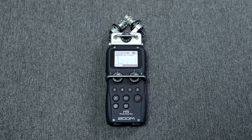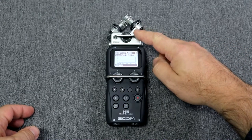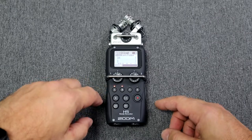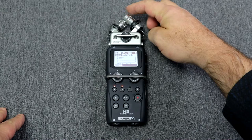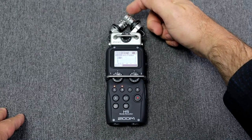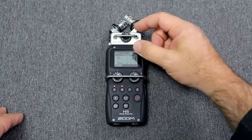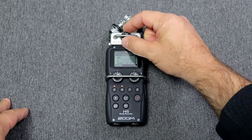How do we start the recording process? First we need to select the microphone — you do that by pressing the buttons left and right; they come on together if you just hit one of them. If you look at those sliders, you can see that when I strike one or the other microphone, the bars move representing the volume of the corresponding channel. In order to start recording we need to set up the sensitivity of the microphones, otherwise known as gain.